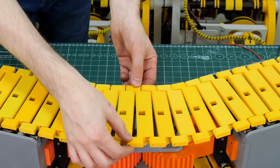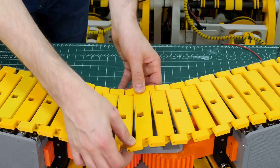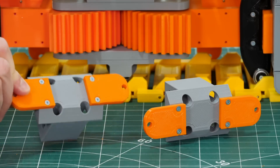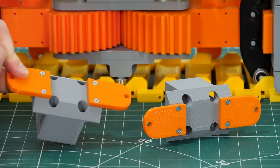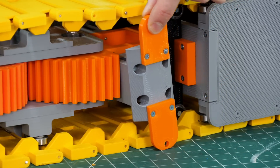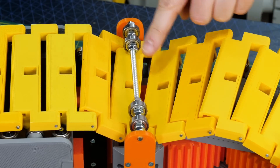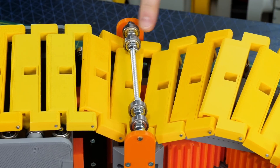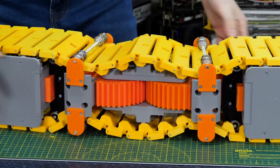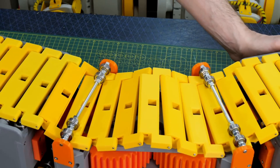The track can still lift off the top or fall off the bottom if I pick the whole thing up. To fix that, I've added extra pieces screwing onto the sides holding bars with extra bearings — bearings on the outside pulling the track down to keep it tensioned over the middle section. It's a bit of a nasty solution but the track doesn't fall off the bottom and should stay on top, while still allowing it to bend.